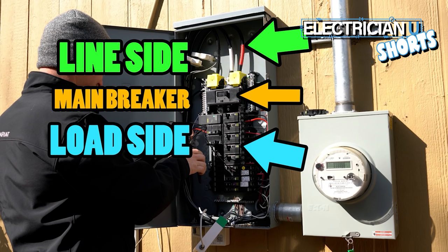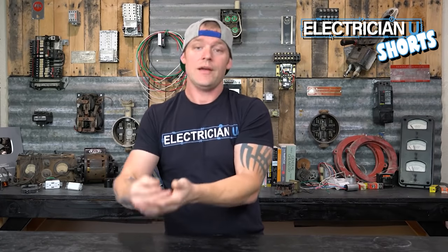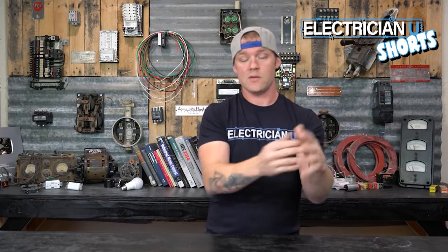You're never going to disconnect live conductors coming off of your meter going into your main breaker and tap these conductors in there. For type 1, you're going to have overcurrent protection already integral inside the device — a lot of them have little fuses on the inside, so if something happens, it has a way to disconnect power on its own.